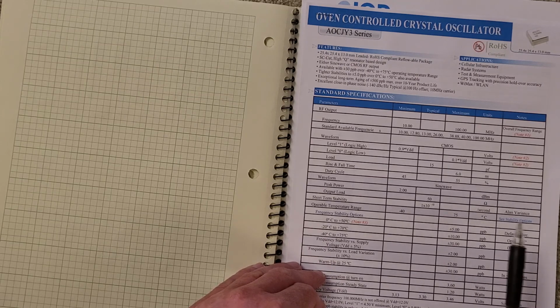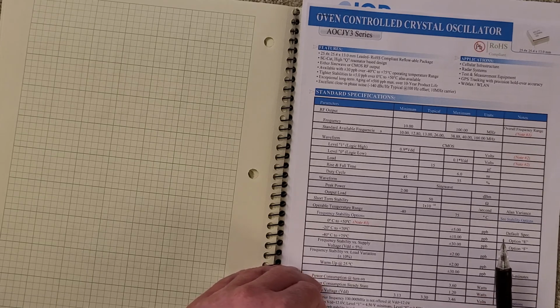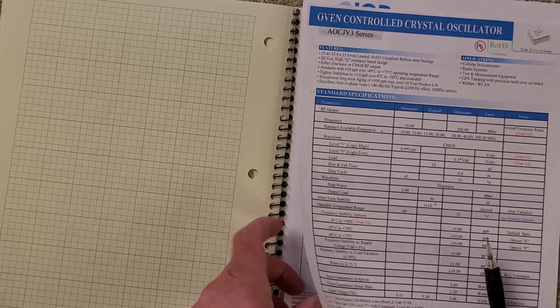The other advantage is it's nominally within less than a part per million of 10 megahertz, and I know just from looking that if I set the adjustment in the middle point for the frequency change, that it's within 0.1 or 0.01 parts per million. So just even turning it on without a GPS, it's 10 times better than the other solution.